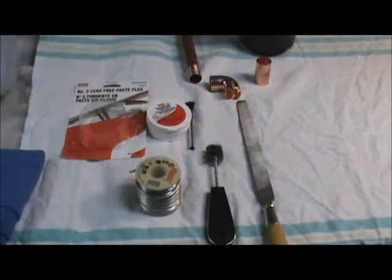Depending on how your tubing cutter cuts, it may leave a little burr that can be hard to sand off, so you can use a file to trim it if necessary. And then we've of course got the copper pipe and the fittings, and I'll be doing this in a workshop environment, but it's much easier for me to show the techniques and tools this way than crammed up between two floor joists under a house or some such situation.